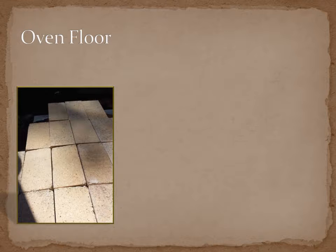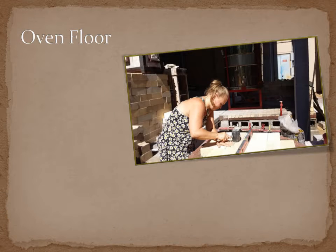Slight cracks will get bigger over time, and make sure each brick is as close to level as possible with the others. When all of your bricks are placed, you're going to tamp each brick with your mallet and check with a level. It's more important to have a smooth surface than be perfectly level. It is, after all, just an oven. The oven is starting to come along, and it's time to get ready to play with some sand.